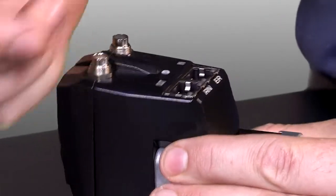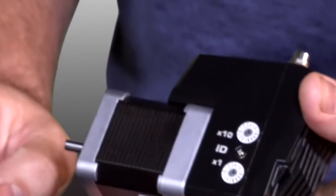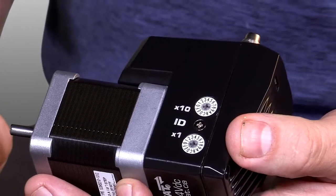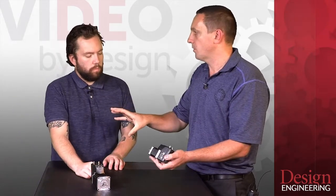We have our power coming in, and our power has separated control and drive power. So if you're in safety situations where you need to drop that drive power, you can, but you can still maintain control which means you maintain position. We also have the explicit ID — dip switches and rotary dials that can be set so you can set up your explicit ID. This is important in EtherCAT in particular, where if maintenance for example switched cables between two different motors, the master system would know and basically say we can't run this system this way because the IDs don't match.